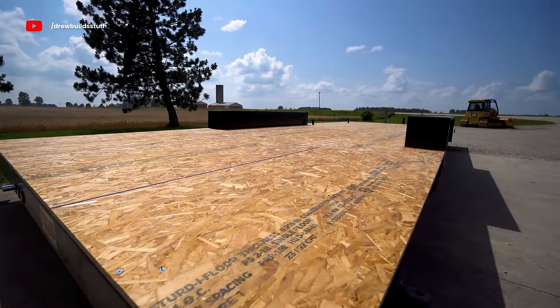So any middle boards will only need those tongue nails, but this runs only two boards wide. So once I got to the end, I would just sink a nail as close to the edge as possible. And then once the fascia cover goes on, this will also get covered up and there won't be any exposed nail heads.